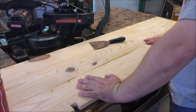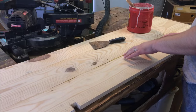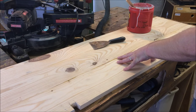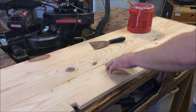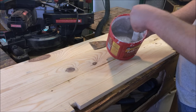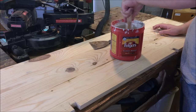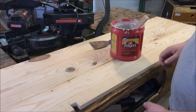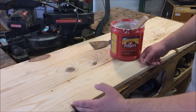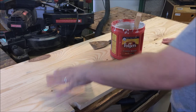This technique I learned from John Peters on his channel — it's a technique to fill holes and voids in your wood. I made a mistake when I put this in: I put the bad side up when I made all my cuts, and since this is custom fit to that dresser I can't just flip it over. So I had a few voids and nail holes. What he uses, and what I've been using with very good results, is drywall compound — drywall mud. I've got a five-gallon bucket from when I remodeled my bathroom. When I run out I'll just buy the small pre-mixed containers. Once it's mixed it has a shelf life, so those small inexpensive containers are great to keep around. I think it gives better results than wood filler because you can sand it down and get a really silky smooth finish, which on pine when you paint it is hard to do otherwise.